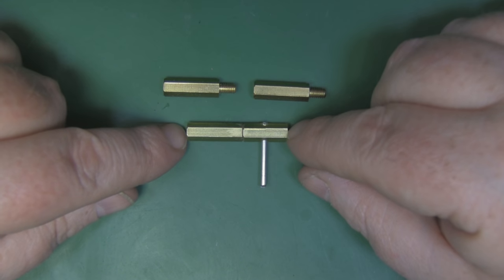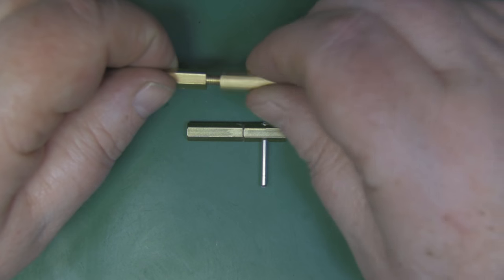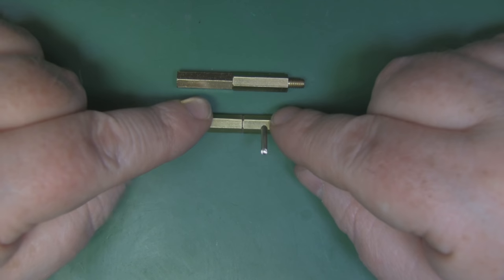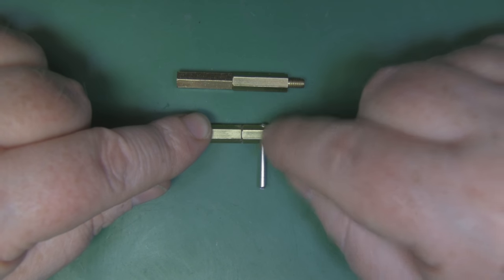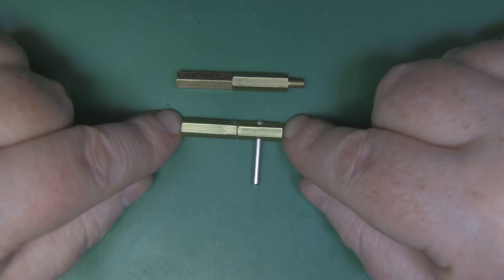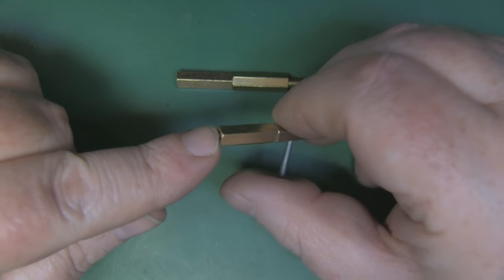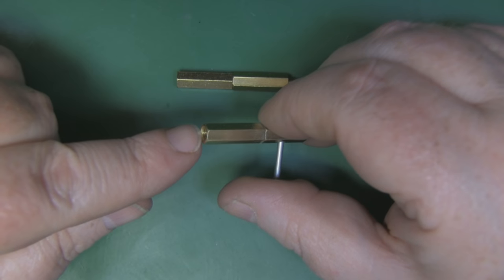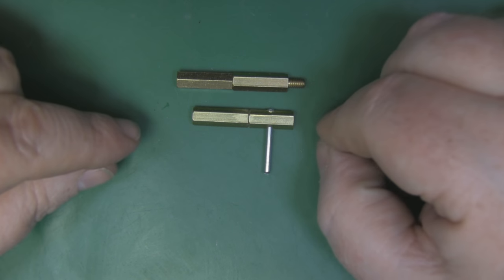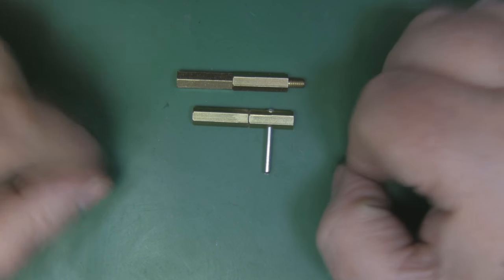My second method uses two brass spacers screwed together to get the right length, then drilled through the center — quite easily since they're hollow inside. I cut the end to get exactly 34 millimeters on the driven element. Because these are spacers they're already nicely tapped, so I can screw this directly to the side wall of the waveguide slot for a really good connection. This is the method I'm going to use in the construction of this antenna.